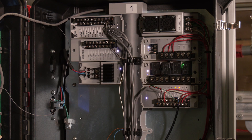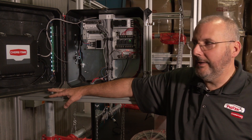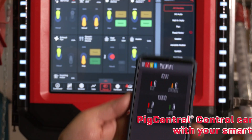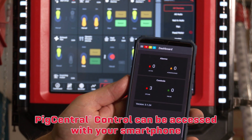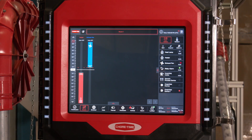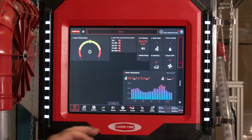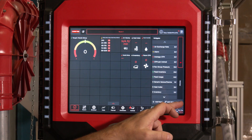You have the option of 11 different slots for cards that can do different things, such as run your chain disc system, run sensors for input, or run fans — anything zero-to-10 or four-to-20 milliamps. You can even add a second and third box if you need more space. When connected to the internet, this control communicates with your smartphone so you can control anything in your barn from anywhere in the world. The room screen gives you all current information on what is going on in the room of your barn. The dashboard screen is totally customizable — you can add or remove any widgets you like. It's as simple as using your smartphone.